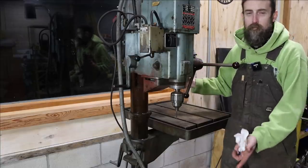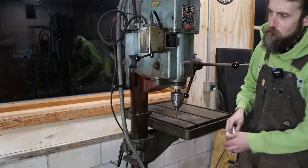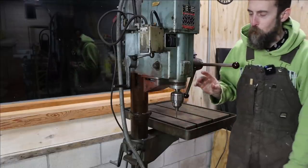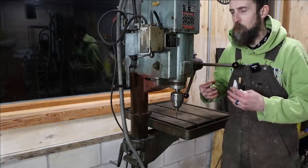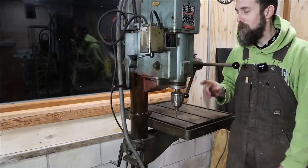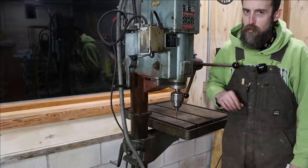So it's an amazing drill press, high and low range on the gearbox, gear driven, high and low on the switch, and reverse. So just an awesome drill press. You can take the slop out of the column. It's just, in my opinion, one of the better designed drill presses that you see out there. It's better than most, that's for sure. Two stops that are settable, just nice.